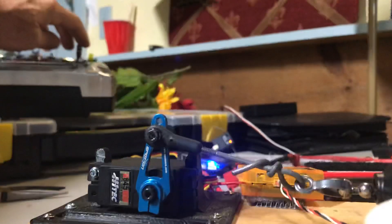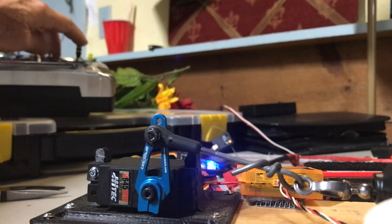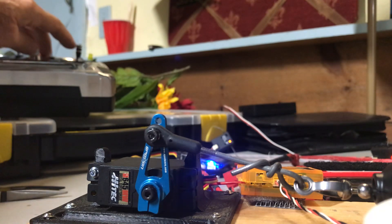I can just read the max, which is around a little under eight kilograms — it was about 7.7 kilograms. I'll do the math later, but I think that's high 200 inch-ounces. By the way, that's at a one-inch servo arm position.